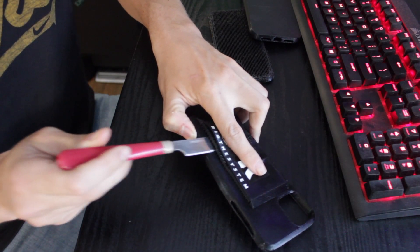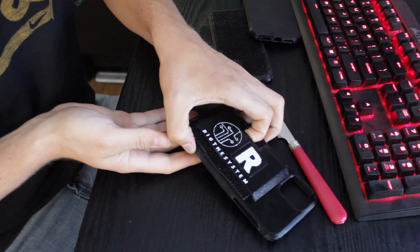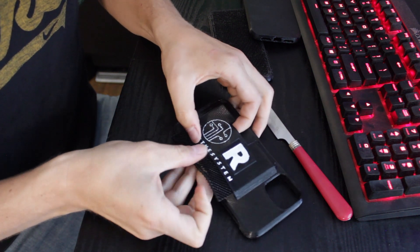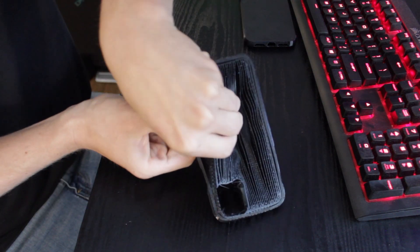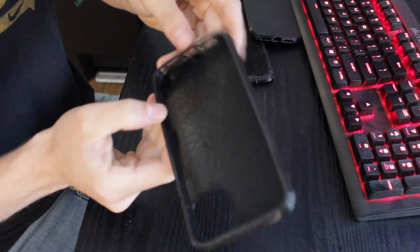I was really concerned that the support material might be difficult to remove — particularly between the wallet part of the phone case and the actual back of the case. But luckily with TPU supports they were flexible, so I just stuck a knife in and ran it along the edges to cut the strings attaching them to the model, then pulled the whole support structure right out. I could not believe how easy it was to remove, and it's really got me stoked on this phone case. I think I'm going to do more flexible projects like this in the future.